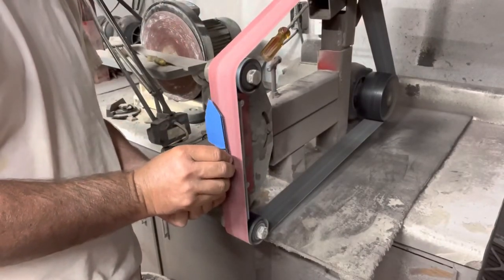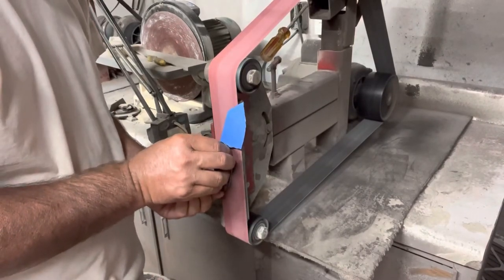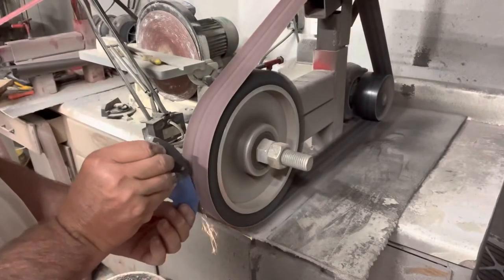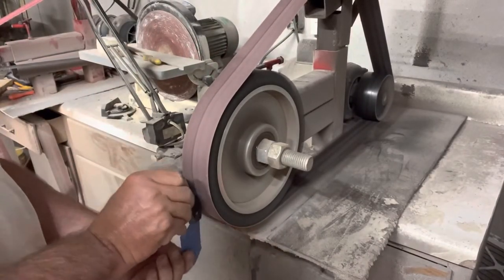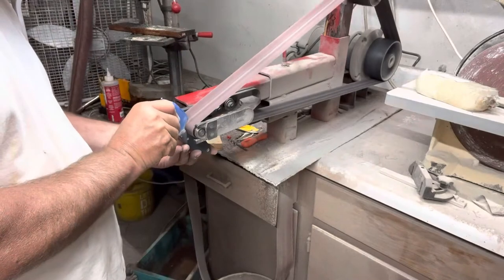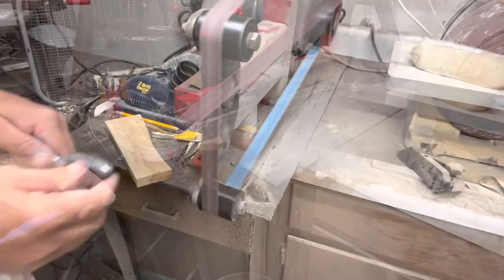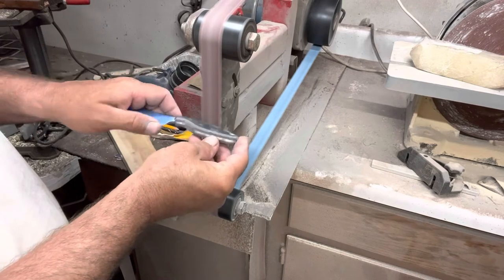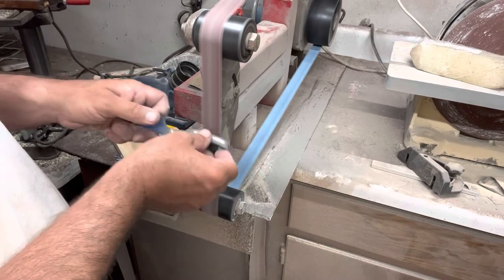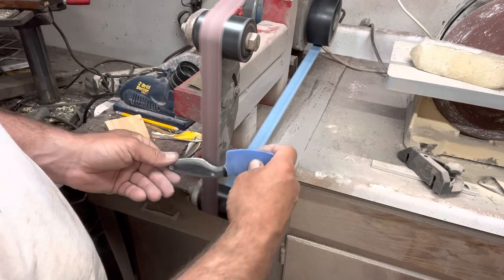Off camera I glued it up, and here you see me doing my shaping and overall contouring of the handle. I went with black G10 — I don't remember how thick it was, but it wasn't very thick. I wanted a small, comfortable handle and ended up getting that. The black G10 turned out extremely comfortable. I just go through the different attachments on my 2x72s — from the flat platen to the big wheel to the little wheel — and I've been using these little one-inch belts, which are great for contouring. I felt like the handle turned out really well.